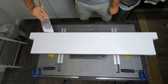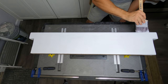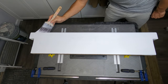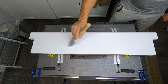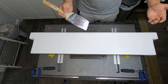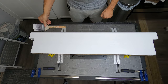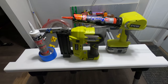Right now we're still putting our thicker coat on the front. There's a reason to spend a little more on higher-quality paint compared to cheap latex paints — this is both a primer and paint in one, so everything gets sealed in that first coat. You can always put a second coat; there's never any issue doing so, it's just not necessary. I may end up doing a second coat just for a slightly better finish, but right now it's nice, clean, and complete. I'll probably do a second coat since this will get scrubbed down as a windowsill.